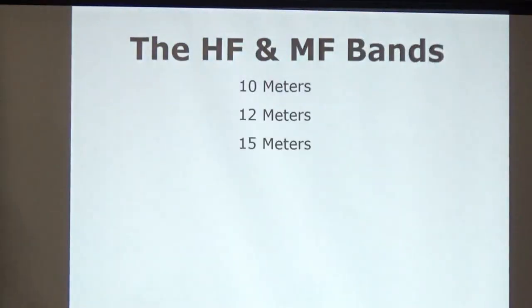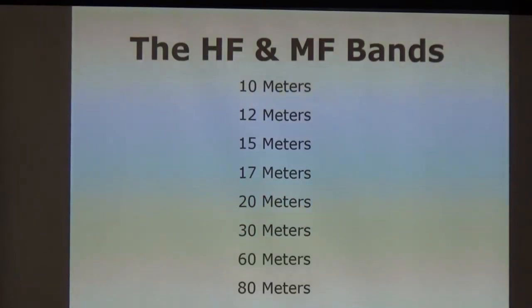Some quick basics. When we talk about HF, we're talking about the high-frequency bands, those below the 6-meter band. Primarily, those are the 160 through 10-meter bands. There are a couple of more bands way down there below 160 meters, but for the moment, those are primarily experimental, and you won't find them on commercial HF transceivers. And yes, I do know that I should speak of the 160 meter band as being medium frequency or MF, but in casual ham speak, all those bands are the HF bands.